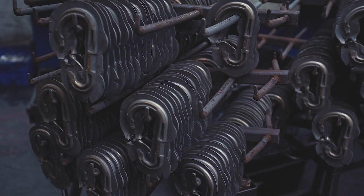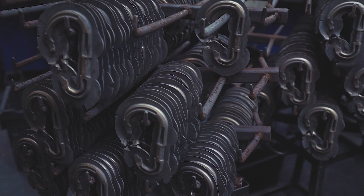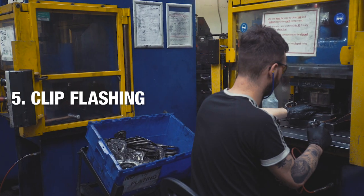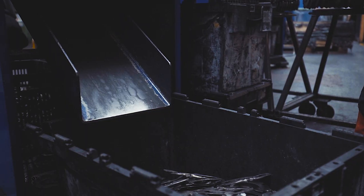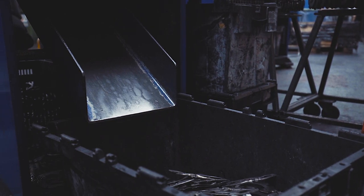When the carabiner has gone through that hot forging and been stamped, there's an excess of metal which is squeezed out of the side as flashing. So the next job would be to clip off that metal — it's a bit like a pastry cutter that comes down and clips off the metal.